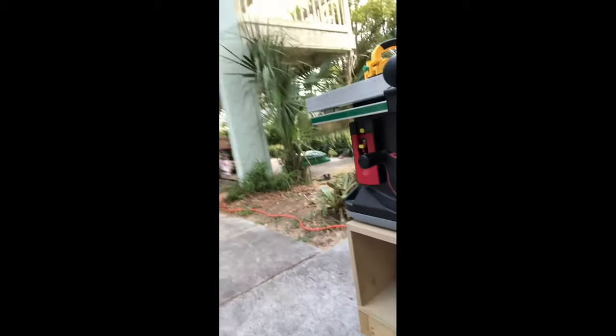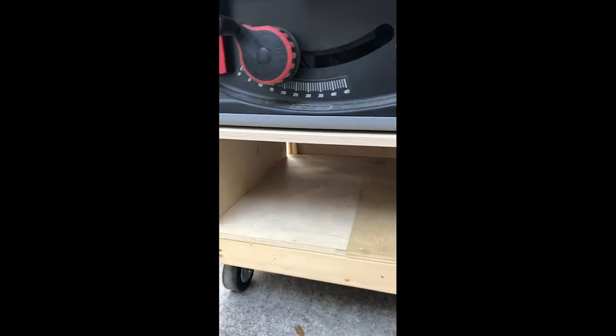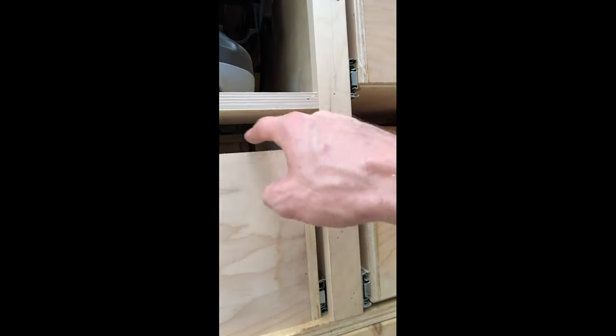Let's talk about drawer boxes. The slides I'm using are about a half inch thick, so I always make my drawer boxes an inch and a sixteenth smaller than the space they're going in. But I can't just measure and subtract because I'm using half-inch plywood for the boxes — and is the plywood actually a half inch thick? Almost certainly not. So what I do is take two scrap pieces of the plywood and the two drawer slides and measure the distance from there to the edge — that is the length the front and back parts of my drawer boxes need to be. I got my four sides cut, checked the fit with the drawer slides and it's nice and snug.